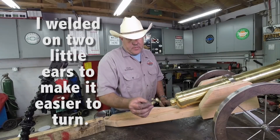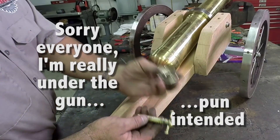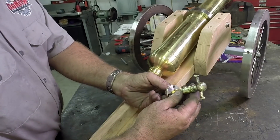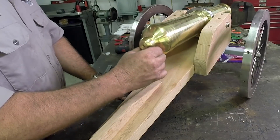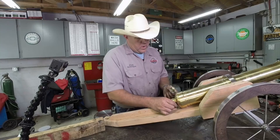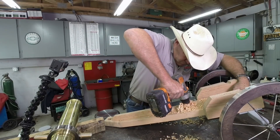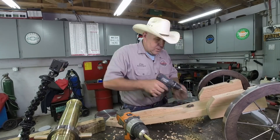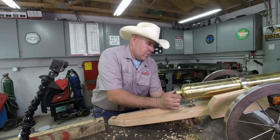We're working on our jack screw — here's how it came out. Pretty good overall, pretty pleased considering what we had to work with. This is the base plate made out of that piece of free-machining brass, threaded like this, with a shoulder here. This jacks the cannon barrel up and down, giving us our elevation. I've already marked where this jack goes underneath, we'll drill a hole with a Forstner bit all the way through and put a couple of small wood screws in it. Let's go for broke — let's put this heavy monster of a cannon barrel on here and see how it works.